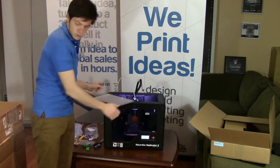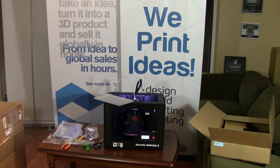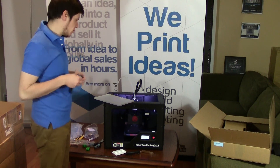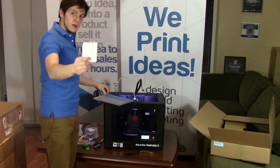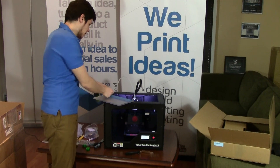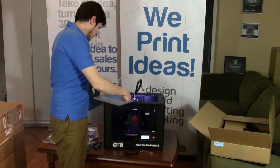So I'm going to start applying some tape. When you're applying your tape, you want to try and do so in a way that removes the most amount of bubbles, wrinkles, or anything like that. We like to use this big 2-inch tape because you can cover it quickly. MakerBot gives you this with the Replicator 2X — please MakerBot, include it with all your replicators. It's an amazing tool and it allows you to set up your machine so much faster. You can probably find this in hardware stores for only a couple of dollars.